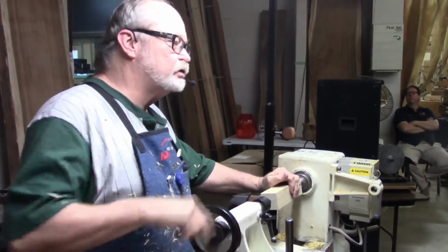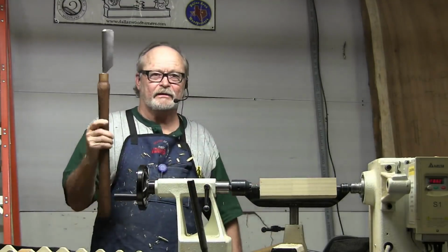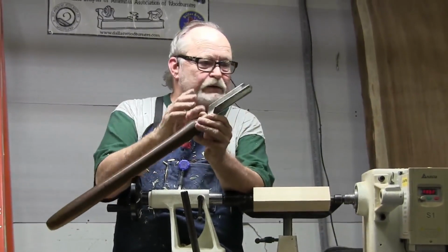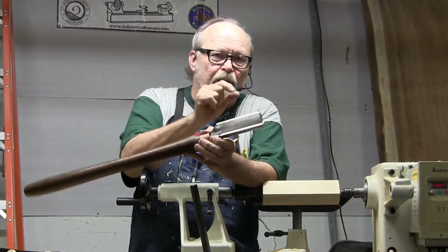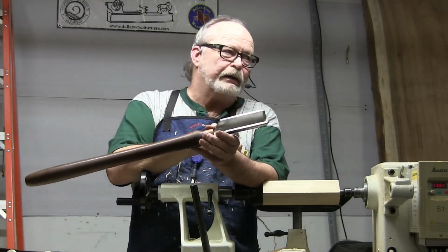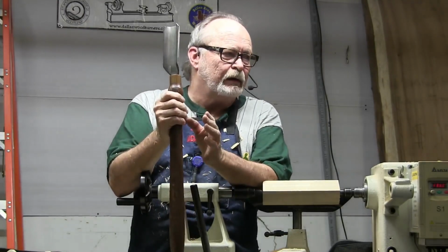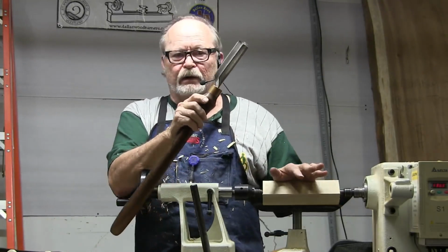You can rough with a skew chisel. Now after the skew chisel, I love this tool. I love that, spindle roughing gouge. This is a good size to do everything from porch columns to ink pens, because the bigger it is, the better it is at leveling. You'd think it's the opposite. No, you need a little bitty one for ink pens. No, you don't. It'll want to surf. Try to cut a straight line. No, it won't. The bigger it is, so don't let the scale throw you with wood turning tools. It matters in carving, where the shape is often dictated by the shape of the tool. That's not how we do it over here. Okay?